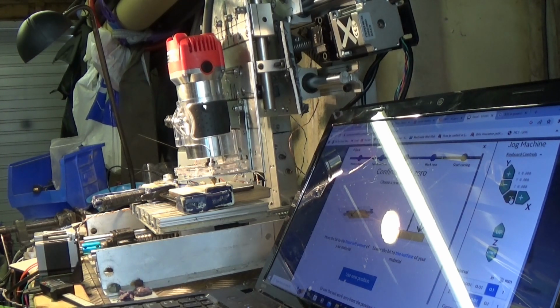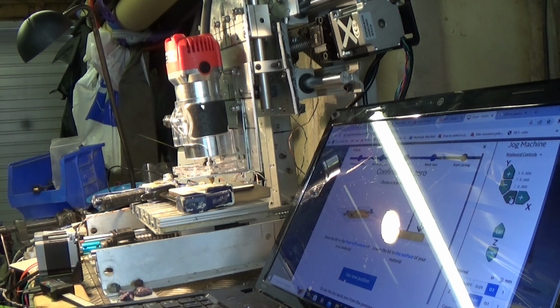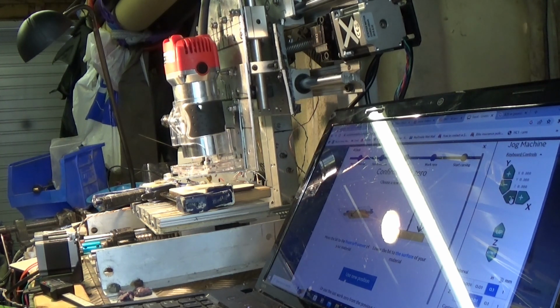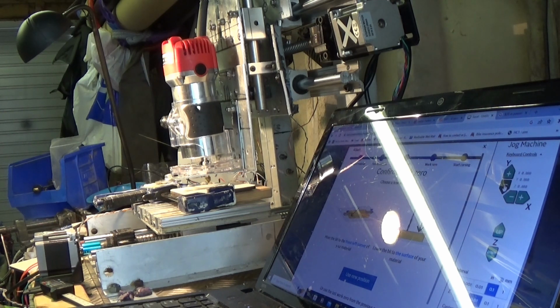Easel is brilliant at allowing you, like other programs of course, to jog the X, Y and Z coordinates so that your router bit is positioned at the front left hand corner of the work, and then from there any drawing you've placed into Easel will be carved out according to the parameters you've set, i.e. material, thickness, type of bit, speeds and feeds.